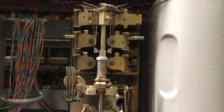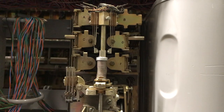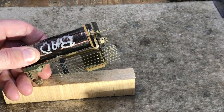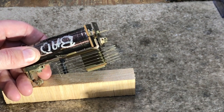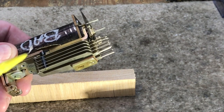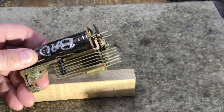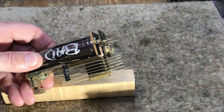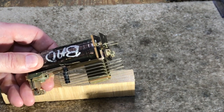Here is a step switch that has six relays in it. The A relay is a loop relay which has two windings. The B relay is slow to release. And then you see D, E, and F — standard generic relays with different windings and different contact configurations. Due to the thousands of different relay numbers manufactured, they had different contact configurations, so unless you get a relay with the same exact number, the contacts or the winding could be different.